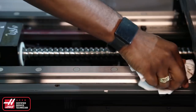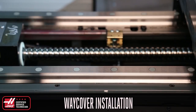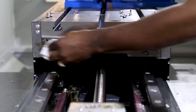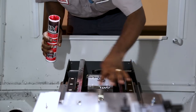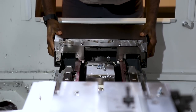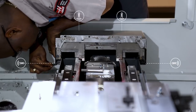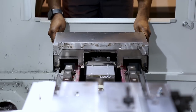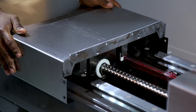At this point, the steps are the same whether you're reinstalling your existing X-axis way covers or installing new ones. Remove any chips and debris from the linear guides. Remove the used gasket and sealant from the table mounting surface and clean it. Apply a thin coat of red-eye grease to the wiper guide bar and install the wiper over the guide bars. Attach the wiper end panel to the wiper bracket with the fasteners.